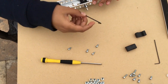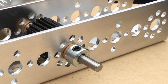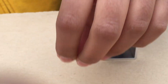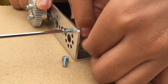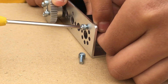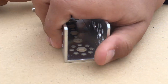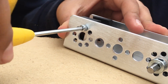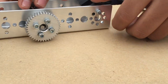Now we will move on to step three. We will now begin part three. Grab parts one and two. Take part two and tighten the screw on the linear slide gear. Then take two short screws and a linear slide stopper and put them on one end of the beam. Insert the two short screws into the side. Then take another short screw and insert it in the other end. Take another linear slide stopper and two more short screws and do the same at the other end of the beam.